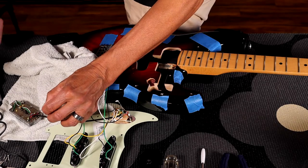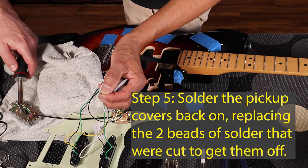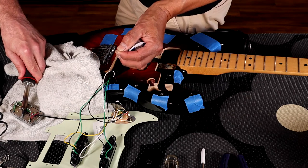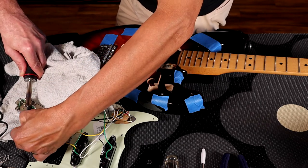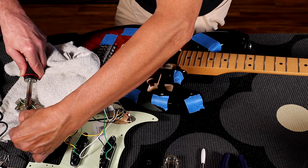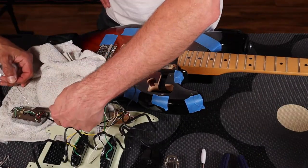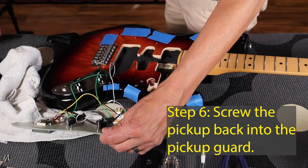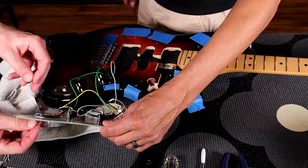Then the advice is to heat up the area first, where you're going to put it. You want the place where you want the solder to go to be between where you're heating it and where you're coming in with the solder. Springs and screws, so this shouldn't be too hard. I'm just gonna get it started.